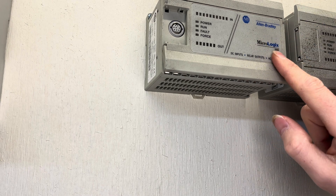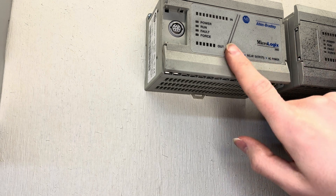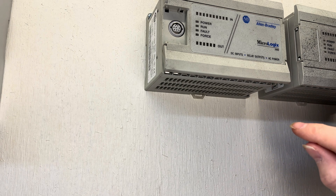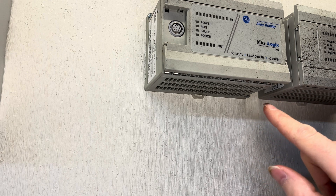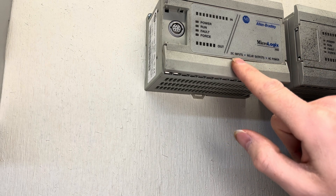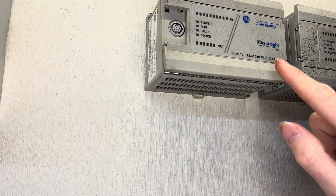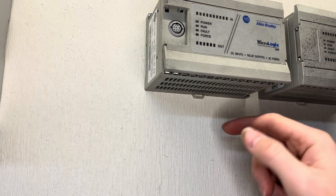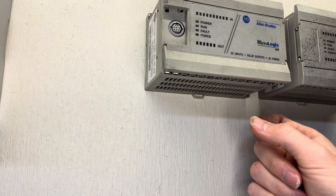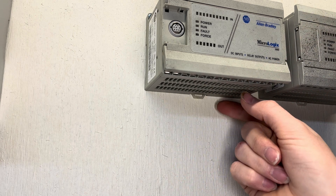In some of the MicroLogix series controllers, particularly the 1000, you'll have a part number that's usually on the side. We have two of them here, and on the side you'll see some different coding and numbers. They'll represent whether it's an AC power input — and by that I mean what's powering the controller as a CPU altogether. This particular one is taking AC power. The reason the depth is so great is that there's a DC power converter inside. It takes the AC power, steps it down, and converts it into a power supply that's built inside.